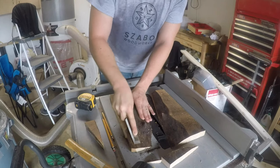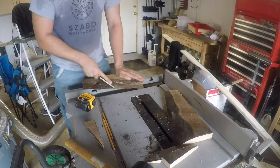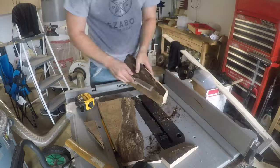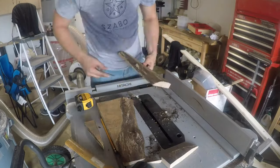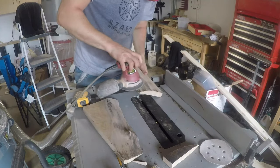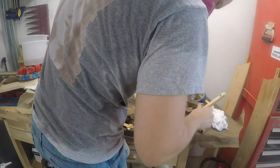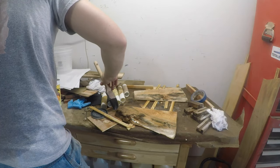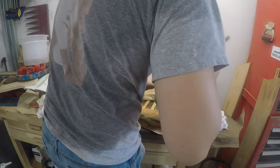What I'm doing here is scraping away all the bark and loose material and then sanding it clean. The loose material can get in the way of the resin forming a strong bond with the wood. Next, I put a thin layer of shellac over the whole piece. This prevents resin from staining the wood where I don't want it to be, and it also helps reduce air bubbles.